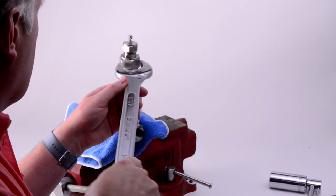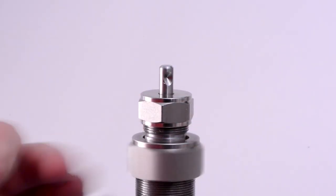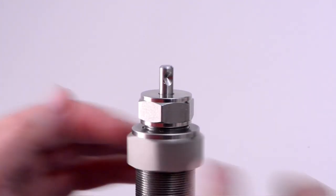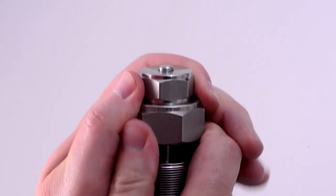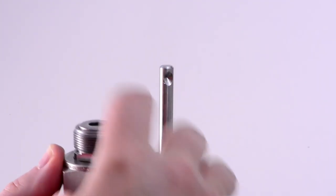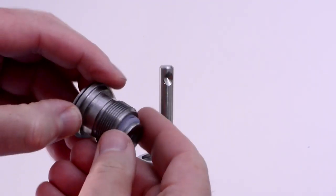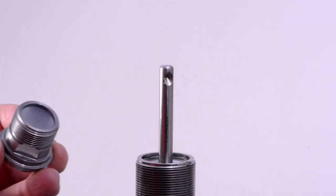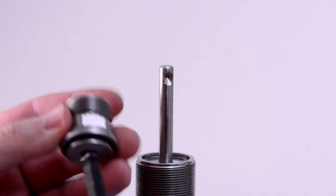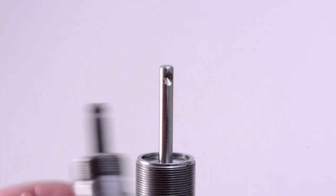Loosen the 1 inch nut that holds the bonnet to the adjuster body using the 1 1/2 inch wrench. Then fully loosen this nut and lift the bonnet assembly up and off. Finish removal of the packing nut by hand, being careful not to drop the Belleville washers. Take the adjuster body nut off of the bonnet and shake the other packing components out of the bonnet's stuffing box. Any parts that remain in the bonnet may be pushed out using the 5/16 inch hex key wrench.